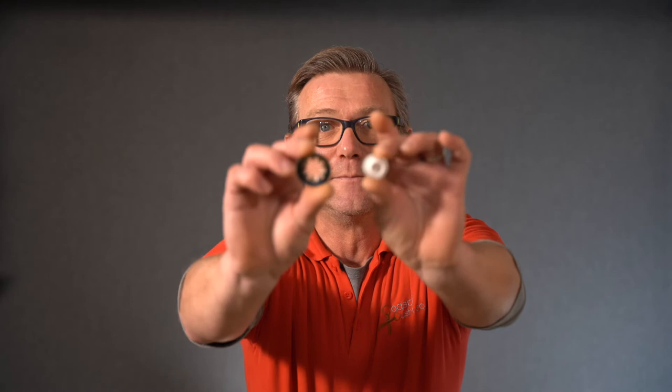Now that the cover's been made, what I need to do next is to glue the board to the foam. This stops the foam from moving around when you attach the cover. But before I do that, I need to put some breather holes into the board itself. It's just a couple of holes that are drilled into the bottom of the board. Alternatively, if you're not on a board and you've got a non-breathable fabric, then use cushion vents. These are just a two-part male and female thing.